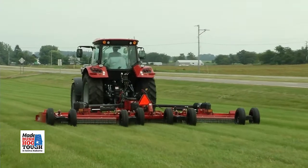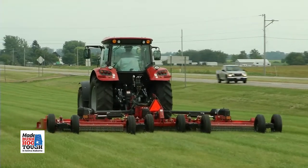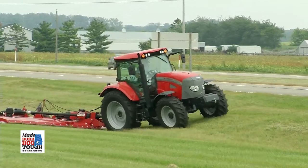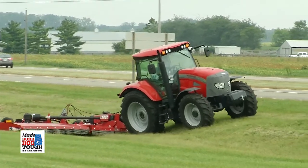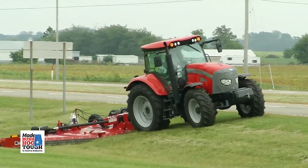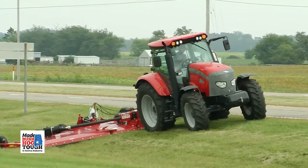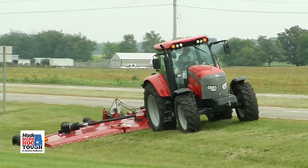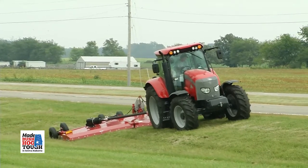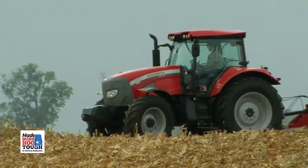It offers many features. The free wing float without movement of each hydraulic cylinder is 22 degrees down and 45 degrees up. Each cutting gearbox has the industry's massive 3-inch output shaft with more splines on it that are deeper for maximum transmission of torque to the blade. Highway travel lights are standard for safer travel on the roadways.